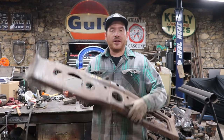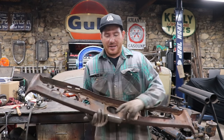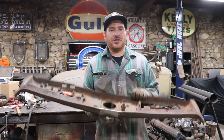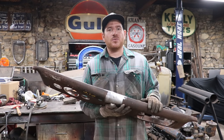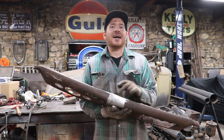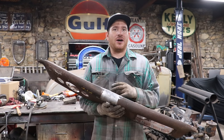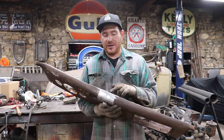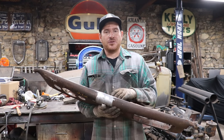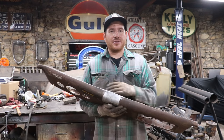All right, so I did a little bit of tapping around with the metal, and in the last shots you saw, I welded up this back seam in the back here where the lip folds over. And what you saw, I didn't describe it as it was welding, but basically I leave a long piece of metal on the backside, I tack it in, form it around, and then I weld up the seam, and then I cut it off, because what happens is you'll fight the edges burning away, and if you have it cut as short as you want it, it will actually burn away on you. It'll be a pain to get everything nice and parallel.